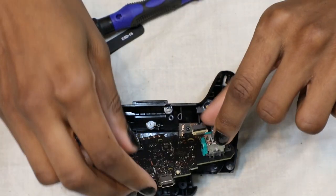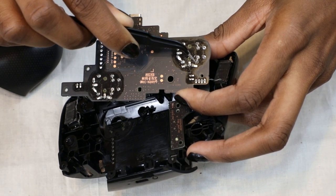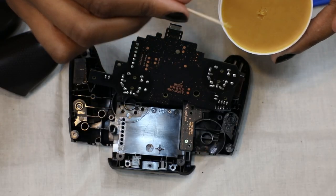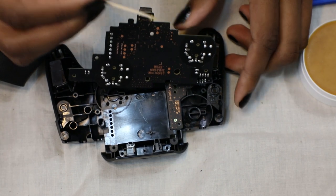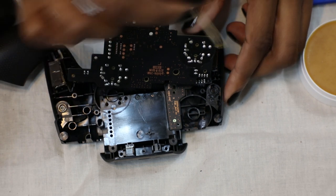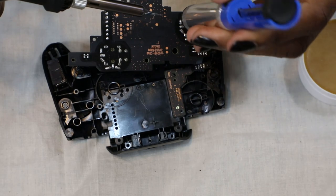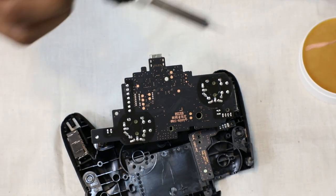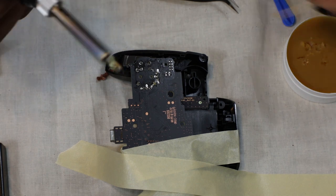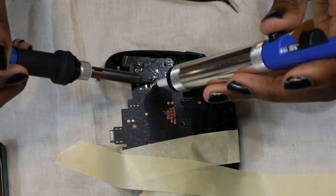This is the module we're going to be replacing. Right now I'm checking to see which pins are connected to it so I don't disconnect any wrong pins, and also making sure that the pins line up with the new part. Now for the fun part — desoldering. First I'm adding flux to the pins before I heat them up with the soldering iron. The flux helps the melted solder bead up together, making it easier and cleaner to remove. I ended up switching to the thicker bit on the soldering iron because the precision one wasn't heating up enough, and I turned the heat up to 400 degrees. I also ended up taping the controller down to keep it more steady.